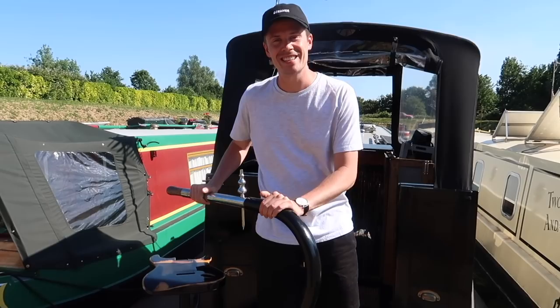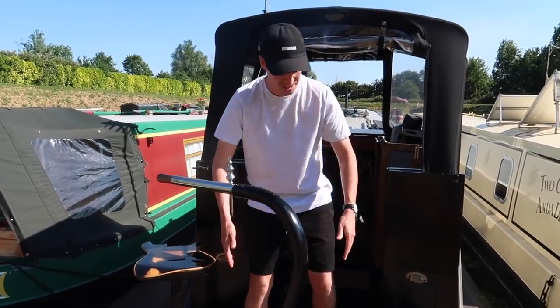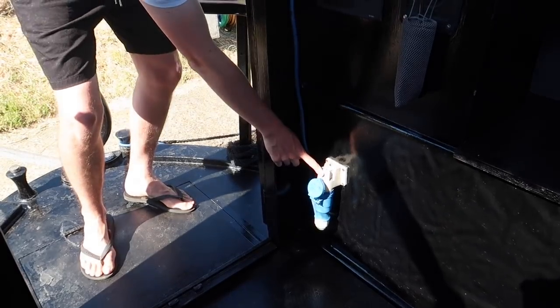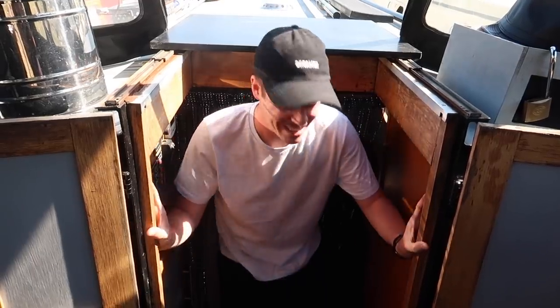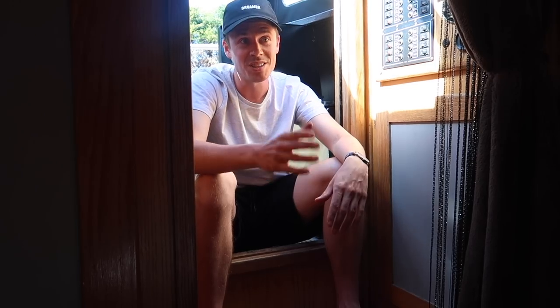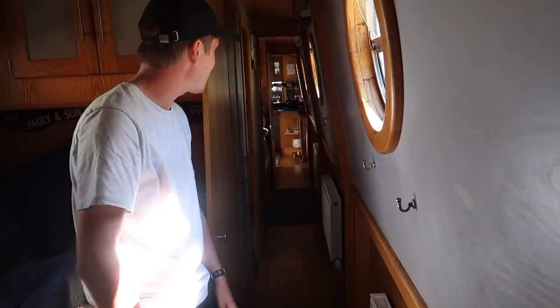All aboard the back of the boat. First things first — the tiller for steering. Dad's got a little cruising chair made from an old guitar, his little happy place. As you step onto the deck, underneath is the engine, the most important part of the boat. You've got an electricity power point running along the floor, a rev counter, your accelerator, and a bow thruster control which helps steer the front end. Stepping down inside, there's a full control panel where you can check fuel level, fresh water level, and control all the lighting and electrics. Underneath is a 3kW inverter that converts 6 leisure batteries from 12V into 240V mains so they can use it while cruising. This boat has a right-hand side passageway rather than a middle walkway, going all the way down into the kitchen.